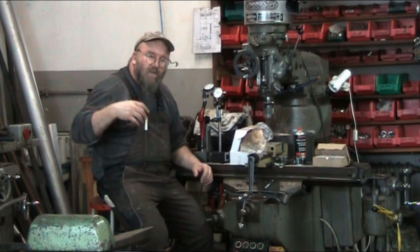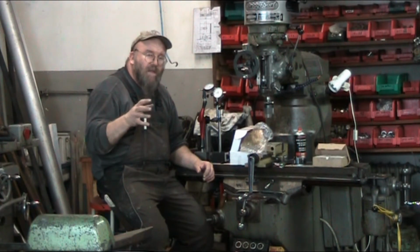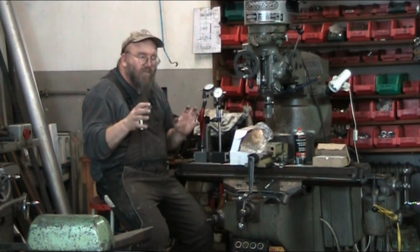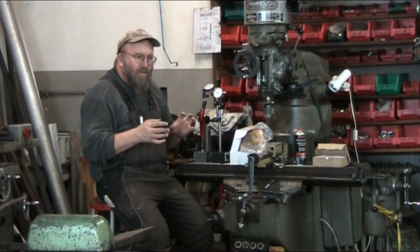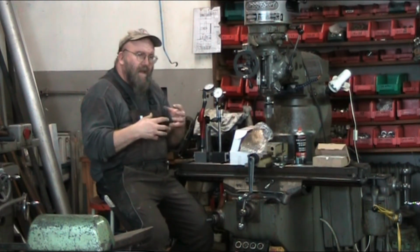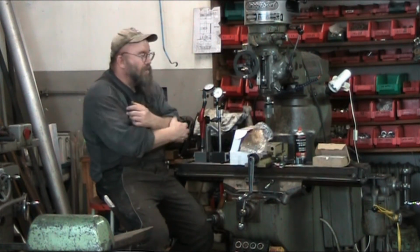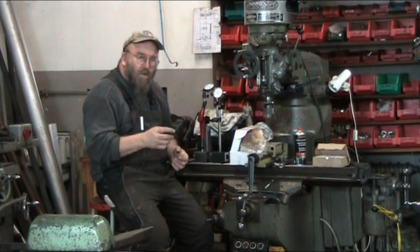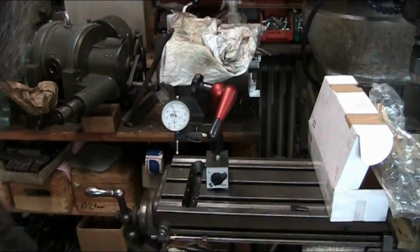So we're going to put the dial indicator on the lathe as well and rotate it once around by hand. Then, of course, probably let it run, turn it at a very low RPM. But we're going to focus primarily on turning it by hand. That way you can see the difference, how the spring has time to compress versus not to compress and so forth. So anyway, let me bring the camera around here and we'll get started on the review, and we'll also get going on the challenge.